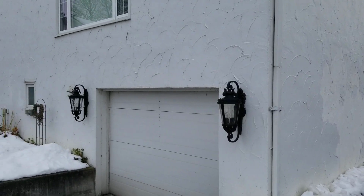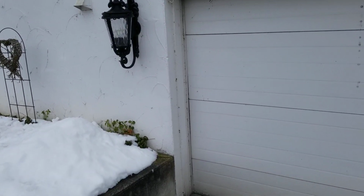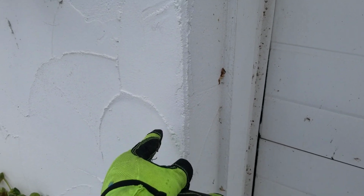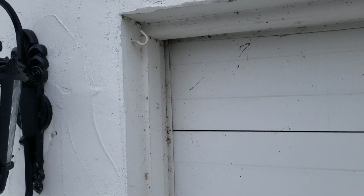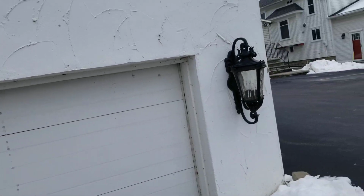The garage door, we're going to have to block and fur around it. We're going to plan on trimming this one around. So we're going to have to bring some furring in here, because we're going to bring this all out 3/4, because this side is going to be 3/4, and then we can go ahead and trim this out with aluminum so it's maintenance free, and get them some blocking for the lights and that.